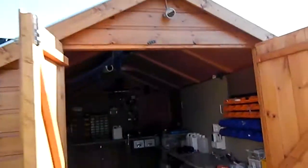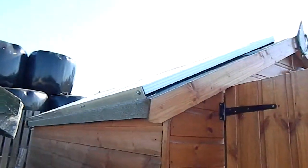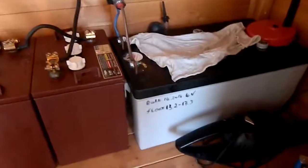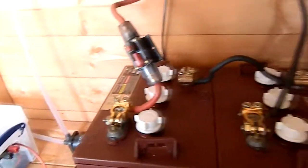This is just a quick overview of my solar shed. We've got 800 watts worth of solar panels — they're just a hundred pounds each. In here we've got a 255 amp hour 12 volt battery and a 225 amp hour pair of Trojan T105s in series. We've also got our circuit breakers there, just in case anything goes wrong.